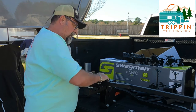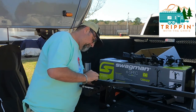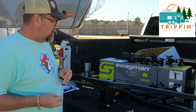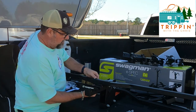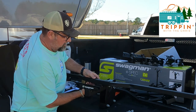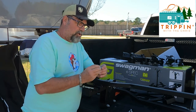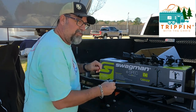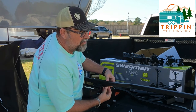There's a cap or cover that goes on over where the carriage bolts go - I really like that detail. The carriage bolt goes down through the hole. When doing the carriage bolts, it's a half-inch nut with a lock washer - make sure the lock washer goes on first, then the nut. The carriage bolt has a little square shoulder so once it's seated and you tighten it, you don't need a wrench on both sides - just one ratchet works fine.